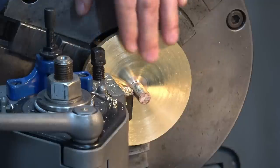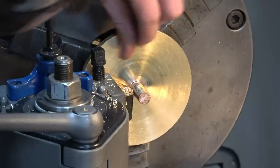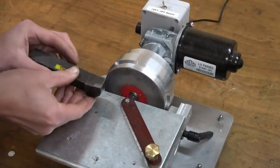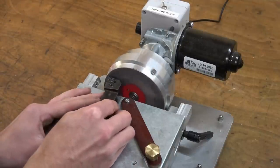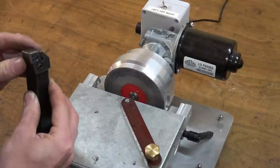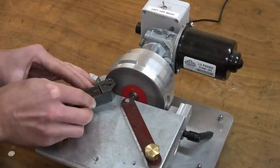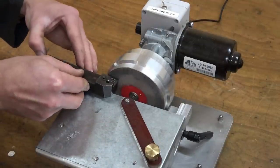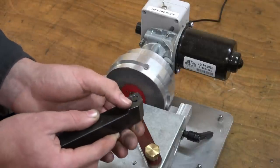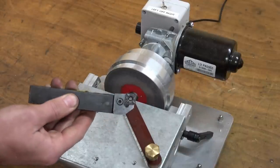Right, I have a feeling that I will get a nicer surface finish using a lapped sharp edge rather than this sintered edge. Let's see if that makes any difference. After lapping, that is now a nice sharp edge compared to the typically presented sintered edge that these inserts have. Still negative rake, but sharper.